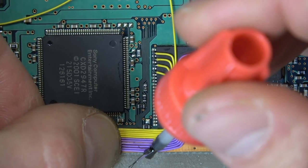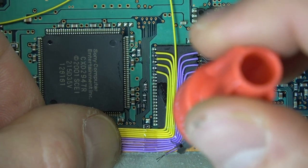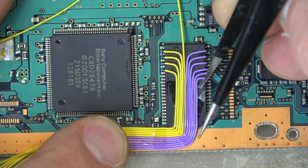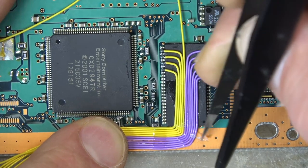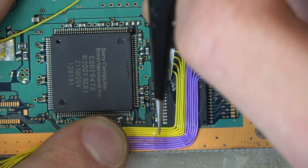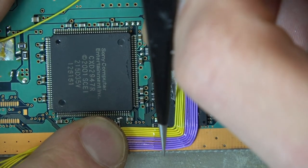I'm trying to get a nice bend going on the wires, then I apply super glue to the top of them only. I always like to only do it on the top because I don't want it to ruin the solder mask of the board. Then I'm just scraping off the excess super glue from on top of the chip with my tweezers.